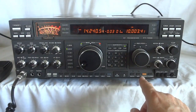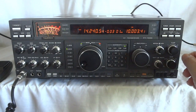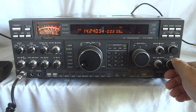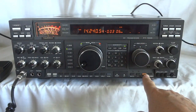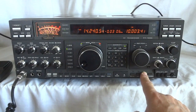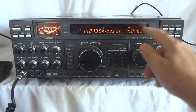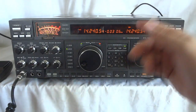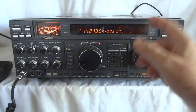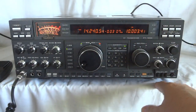This is to move the contents of the VFO to a channel. So let's say we go for the first empty one, which is 6. I keep this depressed, so keep in mind what we have here. I keep this depressed, and now this will be in here. There it is. We just programmed that. So now we have a 6 channel programmed, and that's how you do that. You just set the frequency here, you set the channel number correct, and then you just move it in there, move it or copy it, I should say.